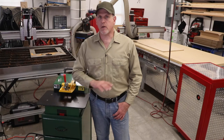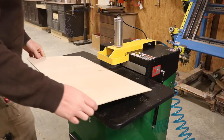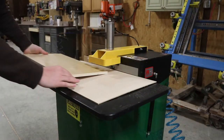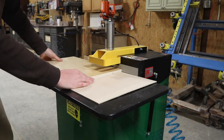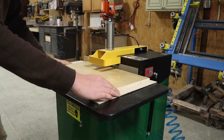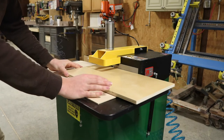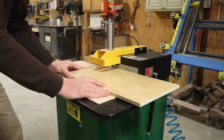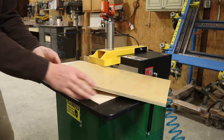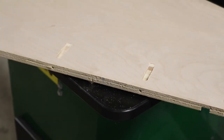The machine is set up out of the box to cut pockets in three-quarter inch material, but it's real easy to accommodate for half inch material — you simply shim the work surface of the machine. We used a cabinet skin, about an eighth of an inch or three-sixteenths. We laid a cabinet skin on the phenolic top, put our half inch work piece in, and cut a pocket. That shim accommodates for the different thickness in the half inch material, and it worked perfectly.